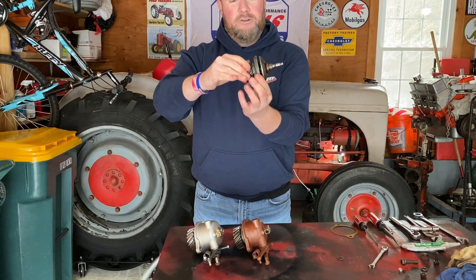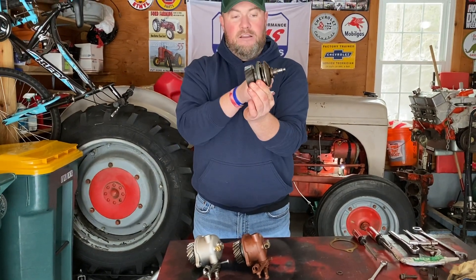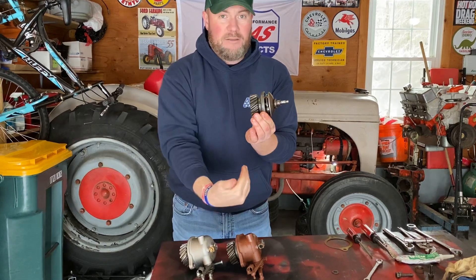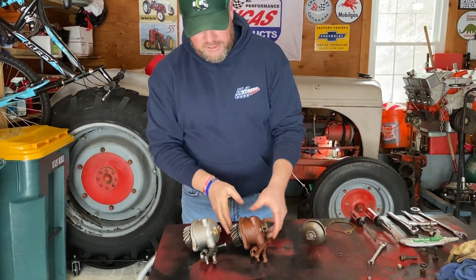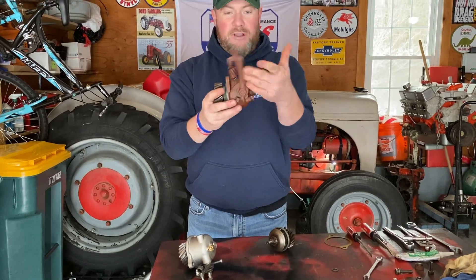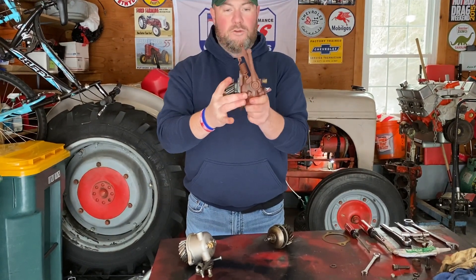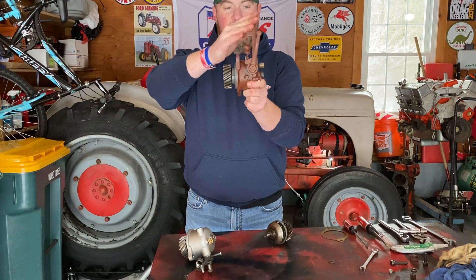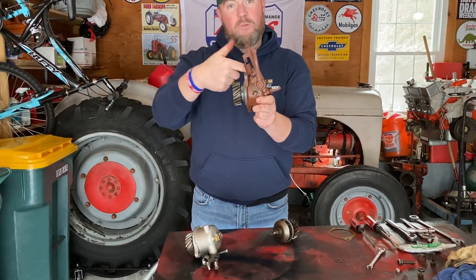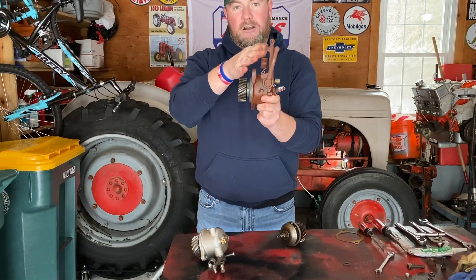Sitting still, you spin it, you can see the balls — the plate flies back, and you can tell that it's actuating something inside the housing. So in a properly functioning governor, which is this one — a factory 8N governor that's been restored, so to speak — watch what happens when I spin the gear. See how the arms came forward? That tells me those balls are working and they're actuating against the arm.